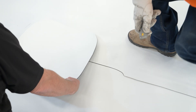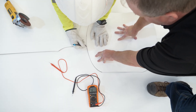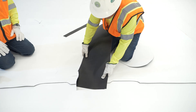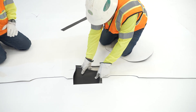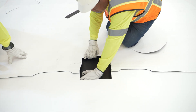Using your patch material, mark on both sides of the liner where you will isolate the patch. Next, cut a piece of material that is about one foot wider than the patch and three feet long. With the conductive side up, insert this material through the opening so that it evenly lies flat under the section where the patch will be placed. This creates a patch connector.